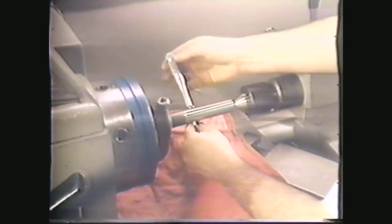Do not polish too long with one grit. Stop the spindle occasionally and check the diameter of the work. Then select the next finer grit and repeat the polishing procedure. Continue polishing with frequent stops to check the diameter until you have finished with the 600 grit and have the finish and diameter you want.